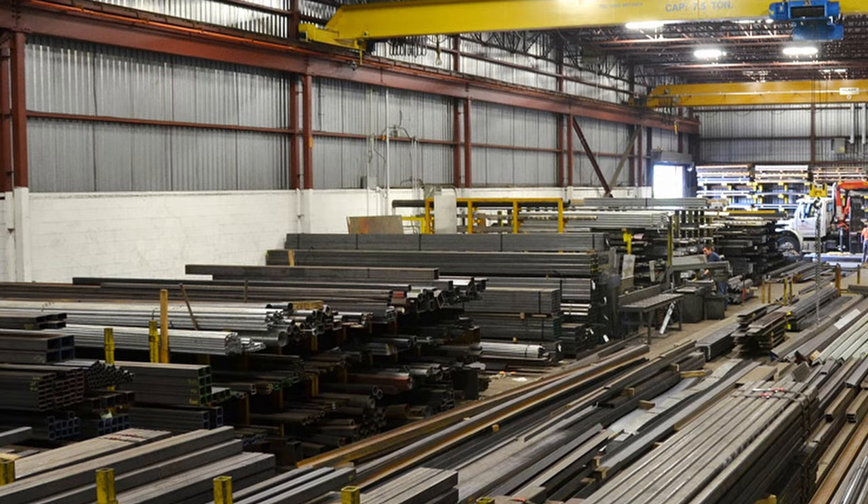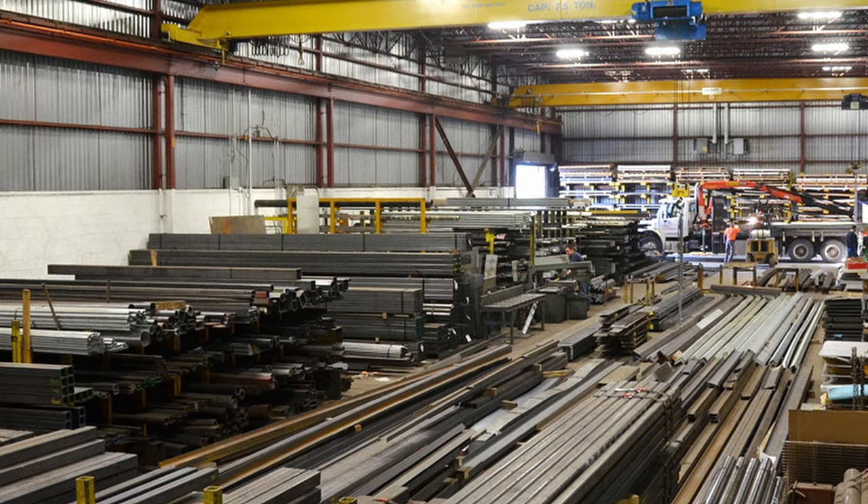You can also go to your local steel places and ask them what they think. Talk to them about the different shapes of steel, because sometimes the pricing doesn't make sense — a two-inch by two-inch by eighth-inch may cost more than two-inch by three-inch by eighth-inch tube, depending on the market. Steel providers will often do cuts for people: if you buy a 20-foot stick, they'll cut it down. Sometimes they also have cut-offs at a discount. It can save you a ton of money on your build.